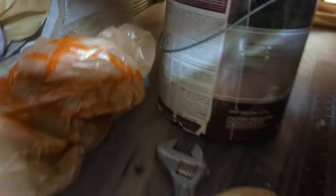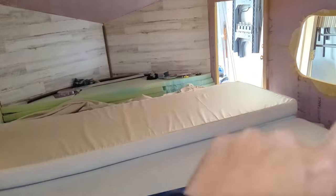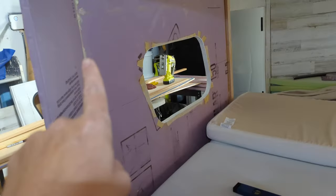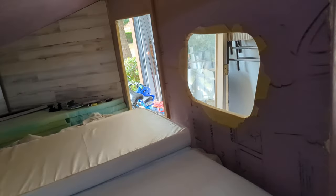This plug goes in through there and plugs into the same power outlet that the AC unit plugs into. I'm going to have an external power outlet right there that is on a totally separate breaker — it's got a 20 amp breaker. The AC unit has a 20 amp breaker. This has a 15 amp breaker. I ended up putting that front plug on the same breaker as this so that I would have a totally separate breaker for the galley power. I'll have two plugs on a 15 amp breaker in the back.